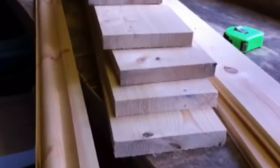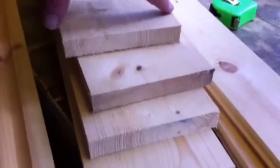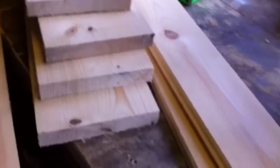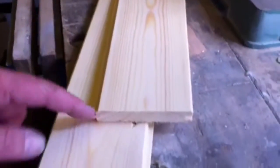These are the timbers we're going to be using. Like I said, it's redwood, softwood, planed all round. This is an architrave. This will go around the top. These are 6x1s. This will be for the main carcass and the shelves. I say a 6x1, it actually finishes 5 3/4 by about 7/8. And the back part of it is going to be 1/2 inch by 4 inch VT&G.